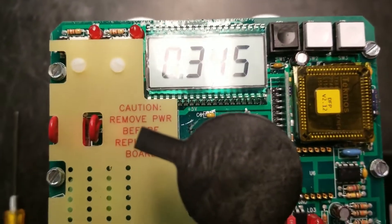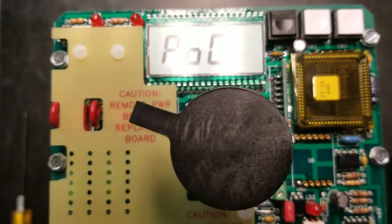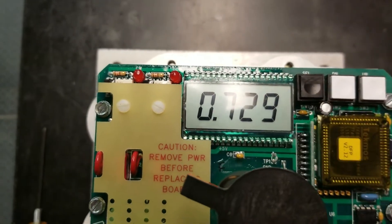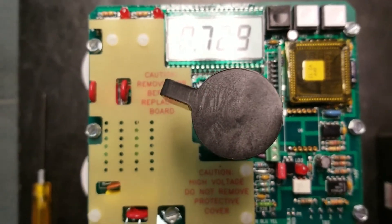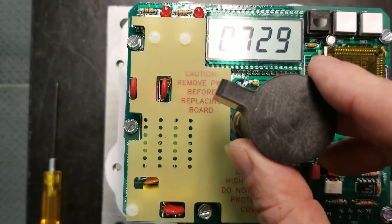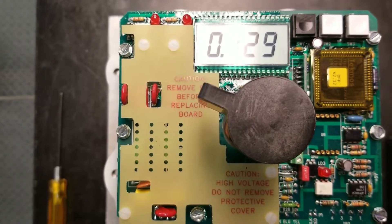We've got 20 milliamps signal to it. Notice our voltage has changed to around 4.423 volts. We'll hit our select button — that stores that value. Then we want to hit our down button again and it's going to flash POC and a number. This is our potentiometer location in the clockwise position. We want to hit our select button and up button at the same time again — it's going to make that live. We want to make sure our shaft is in the full clockwise or closed position.